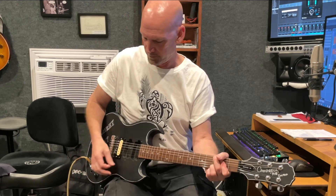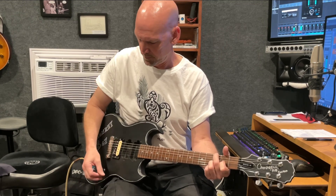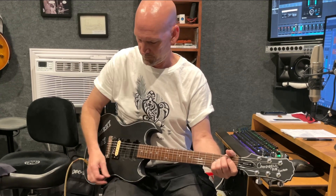And then down to the 2.2k. Now you notice with the 2.2k resistor I can turn down the volume and get it very clean. Notice how bright that is. Now if I had more gain going on, you'd notice quite a bit of hum, but it's not near as much hum as if you split the coil completely, and it's not near as much volume drop either.